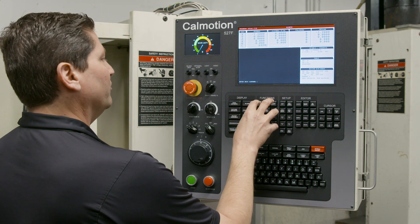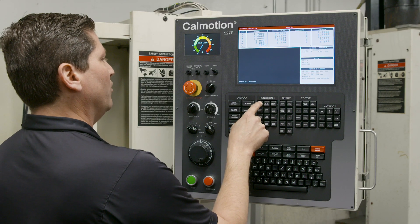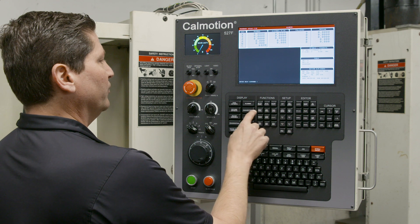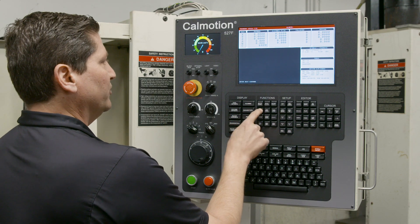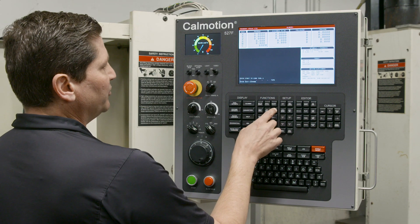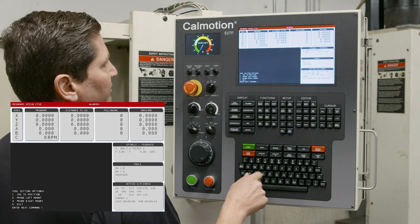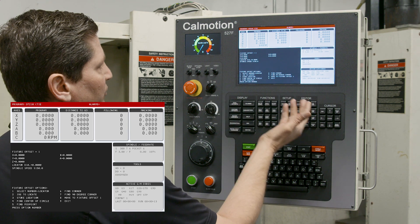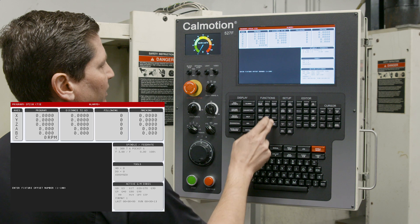The other section is the machine-type functions. One example is go home — you press the Go Home button. Other things include fixtures, tools, getting the next tool, and orienting the spindle. For setting up tools, you can use the tool utility, which goes right into being able to set multiple tools. You can also go directly into the fixture offset utility to set midpoint, center of circles, drills, or jog to locate a certain fixture offset, or go specifically to a fixture offset.